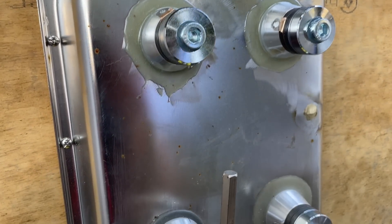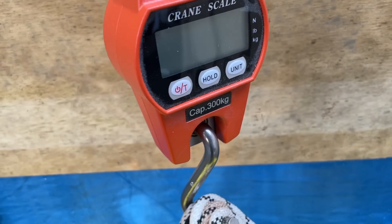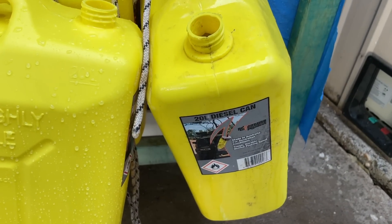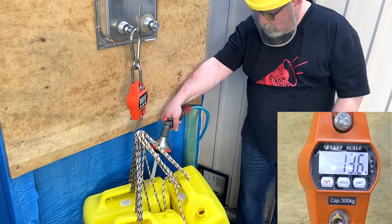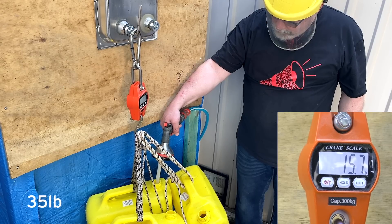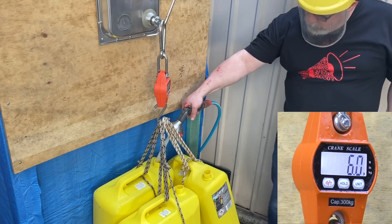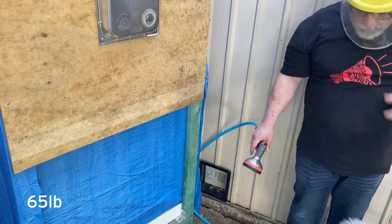Here is my little test tray, screwed securely to a timber board. I'm going to apply gradually increasing force to each transducer using a crane scale to measure the force at the breaking point. I have three 20-litre tanks — when full of water, each will weigh around 20 kg. I'll gradually fill each one until the transducer falls off and record the weight at that breaking point. I strongly doubt they'll take more than 60 kg, but if they do, I think we can consider them pretty well stuck. The first test is the transducer stuck on with JB Weld — after just 15.8 kg of force, it gave way. The second test uses high-strength epoxy adhesive, and this one lasted until 29.3 kg — almost twice as strong as the JB Weld.